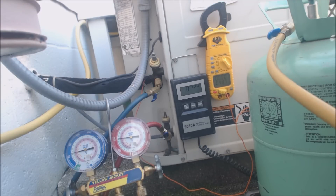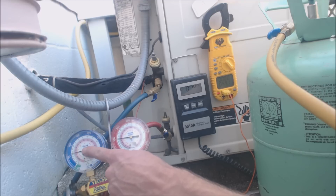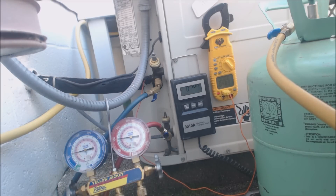Presently we have 14 ounces in there. We have about 33 degrees saturated and about 59.5 to 60 PSIG — 33 degrees saturated temperature in the middle of the evaporator coil. We have about 49 degrees of superheat, and the readings have basically stopped moving — we're no longer dropping in temperature. I think we're right at the max of that evaporator coil. It's a really old capillary-style metering device in a small evaporator coil — about 48.5 to 49 degrees of superheat.